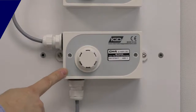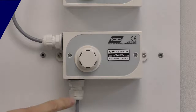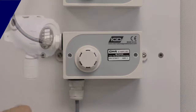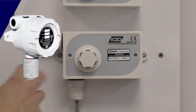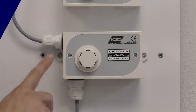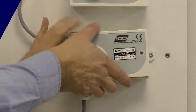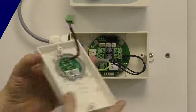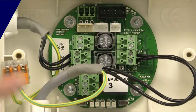Okay, so this is one of our two-wire safe area gas detectors. These come in Ex form as well — our printed circuit board inside is exactly the same. We don't differentiate in terms of the electronics or the quality of the analysis going on here between safe area and Ex. So we're just going to pop the lid on this and we'll have a look at how we're connecting up inside. We're unplugging the sensor and then we can see the internal connections onto the printed circuit board.